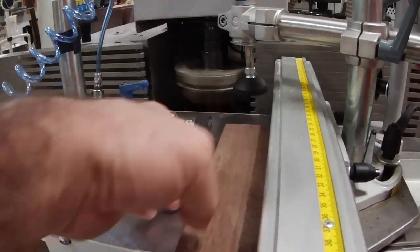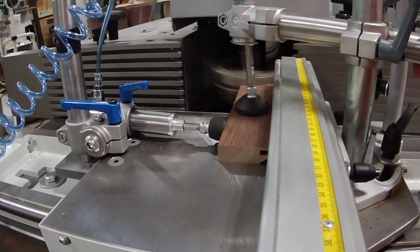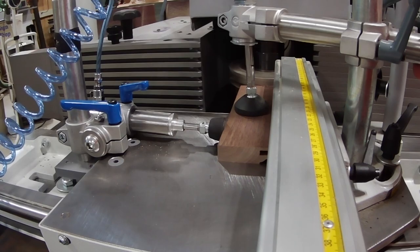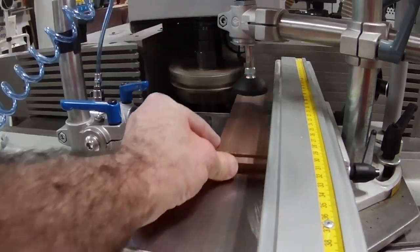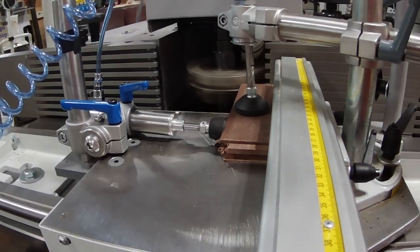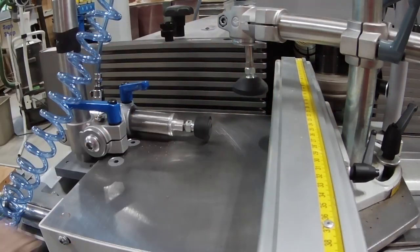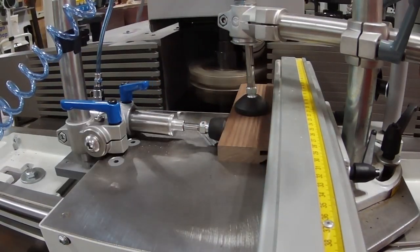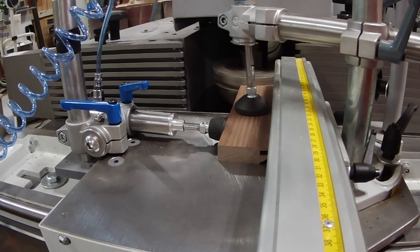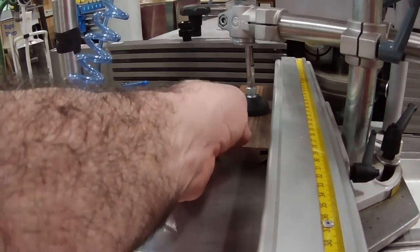You can achieve cope cuts without a sled like this. Fundamentally, you need some way to secure the parts and pass them at an exact 90 degree angle across the cutter so that you get a square cut and the door glue-up is square. We're very fortunate in our shop to have this incredible Martin machine, but we certainly didn't start here. This is the fifth shaper we've owned and we built hundreds and hundreds of doors prior to owning this one.